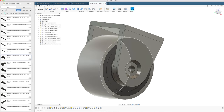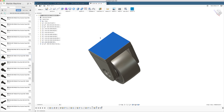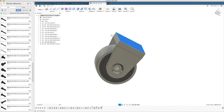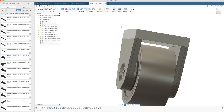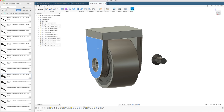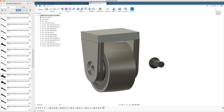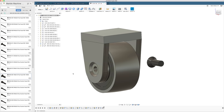To get inspiration here. Gonna make this thicker, just because the flat bar we're gonna weld to this is probably gonna be more something like 8mm, so it's nicer to weld the equal thickness. Change of plans. We're gonna change to an M6 bolt, and I'm gonna have the outer wall be 4mm thick and the inner holding the shaft be 2mm thick, just to get a nice, good countersink without clamping on the shaft itself.